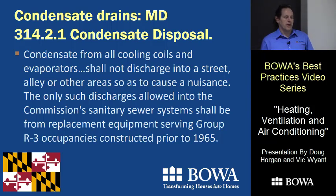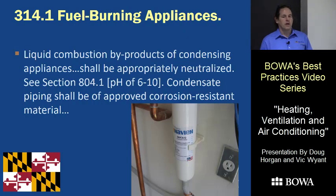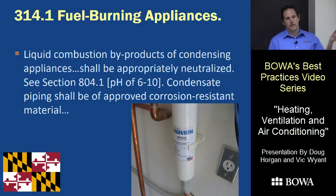In Maryland, you're not supposed to put air conditioning condensate into the sewer — WSSC says unmetered water can't go into the sewer, so you have to do something else with it. You are allowed to put gas furnace or hot water heater condensate into the sewer as long as it's been neutralized using a device that costs about $100 — the condensate goes through it and changes from acidic to neutral. Running condensate outside in winter is a problem because the pipe end can freeze at 10 degrees. A humidifier drain, since that's metered water, is allowed in the sewer.